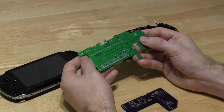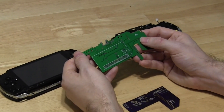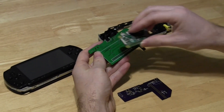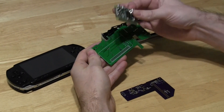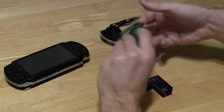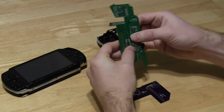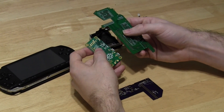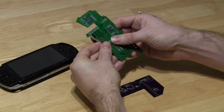On the bottom side of the board you've got pads for the battery and for the USB connector. One really cool thing about this board is the way the Raspberry Pi gets attached to it. I've given an outline of where the Raspberry Pi actually sits and it's got pads for directly soldering it to my board, which gives you all the GPIO and also the pins for the micro SD card.